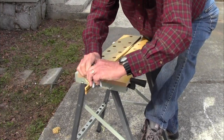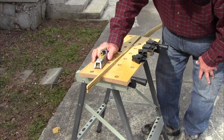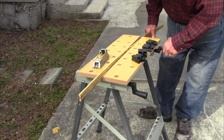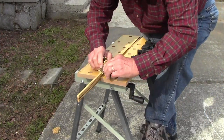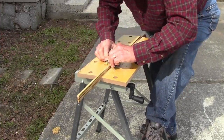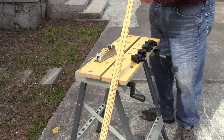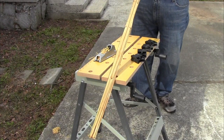I'm working each side of each limb down to a pre-established line, double-checking regularly to be sure that I am getting straightness through the center line. The work proceeds pretty slowly because of a less than secure and stable workbench — you get what you pay for.